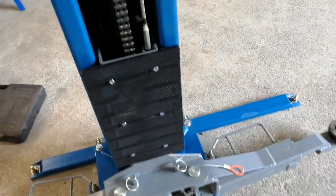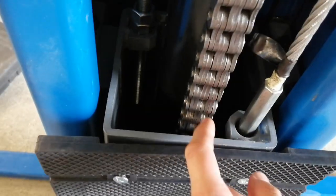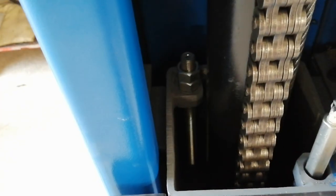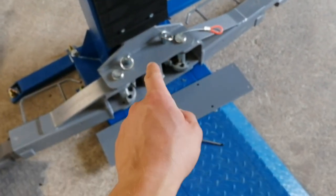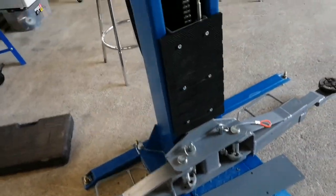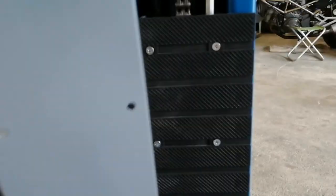The other issue I had was the cable adjustment. Once you put the cables in with the two nuts, I used all the thread — locked them all the way up so both nuts are at the end of the thread. These are the adjustment nuts. When adjusting: doing the nut up clockwise on one side will lift that side up, the same as undoing the nut on the other side will drop that side down. The opposite nut is the adjustment for the other side. Once you've adjusted, you'll need to put the covers back on — unscrew the four screws, slide the cover behind, and then screw the rubber strip back on top.